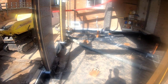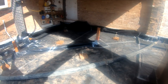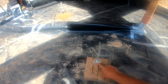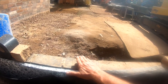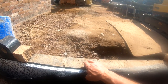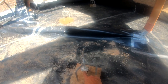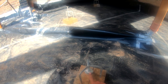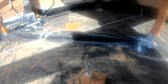Inside here you can see we've got all the damping in and we've put all the pods in. We set them with the laser level — setting to the top of the pod at 220mm from damp. The sill of the door will sit on top of this, and we put some damp on this and flap it down so we have a continuous damp all the way down. We measure down 220mm and literally set all these pods, turning them clockwise or anti-clockwise to pull the self-compacting, self-levelling concrete up to this level. We then take these bricks out because we don't want to leave them in.